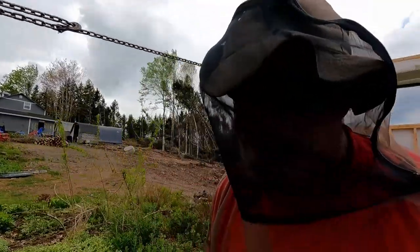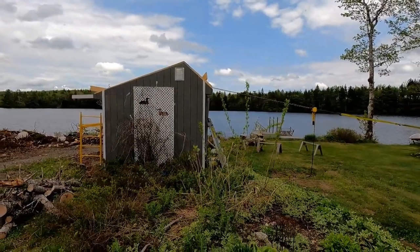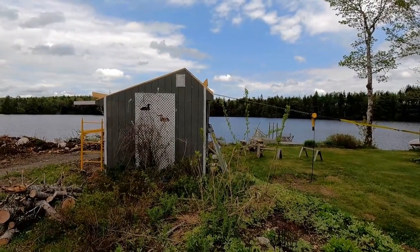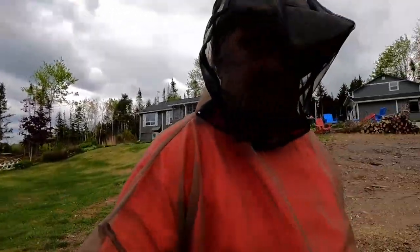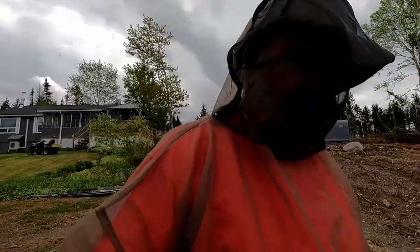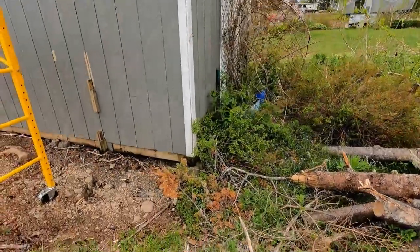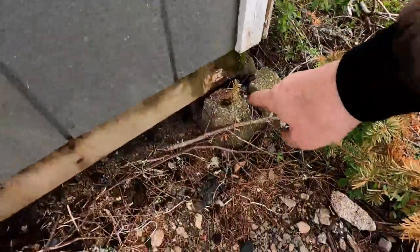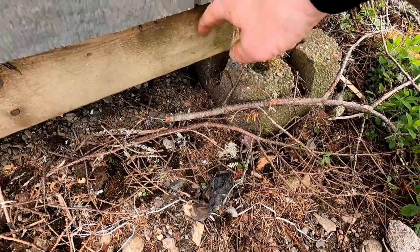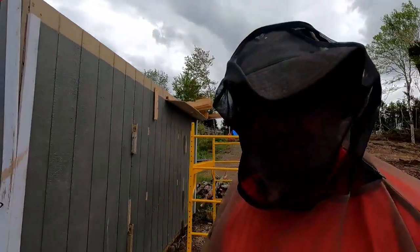Let's go look at it from up the hill. I don't know, man — still looks like it's tipped to the left to me. And then the other thing I was checking was down here at the back side of the boathouse. Check that out. See that deck block right there? Well, that 2x6 was set right down in the deck block and now it's raised up at the top of it. So that's not what I was after — tipping the whole building over.